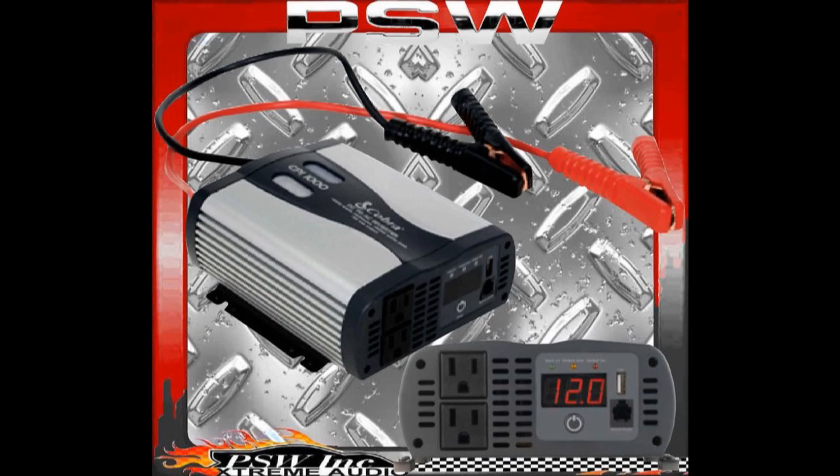When I was building a house with solar power in mind, I got impatient waiting for my Trace inverter to come in, so I went to Walmart and bought the biggest inverter they had. I tied it halfway through my battery bank for 12 volts and wired a plug from the house mains into it — I was only going to run a TV and lights. As soon as I switched it on, it immediately burned up. I checked the house wiring and everything was okay, so I assumed it was a bad unit and returned it. When I got the replacement home, I hooked it up to the batteries, plugged a light in and it worked — then I plugged my house mains into it and it immediately went up in smoke.